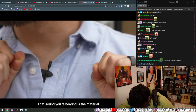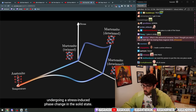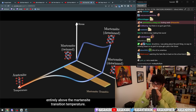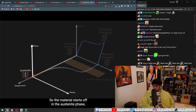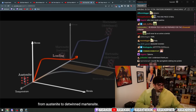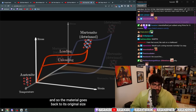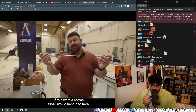Back to its original configuration once the stress is removed and the atoms return to the austenite phase. That sound you're hearing is the material undergoing a stress-induced phase change in the solid state. On a stress-strain curve, this transformation is occurring entirely above the martensite transition temperature — the material starts off in the austenite phase, then the applied stress induces the phase change from austenite to detwinned martensite, and when that stress is removed the atoms spring back to the austenite phase.